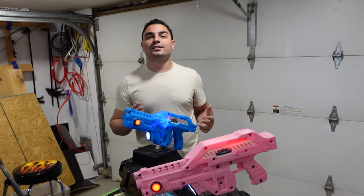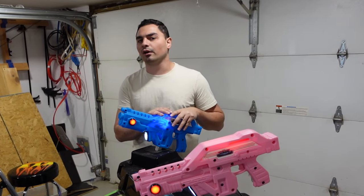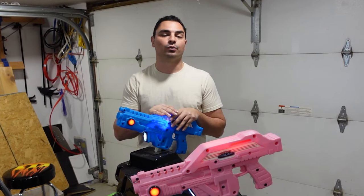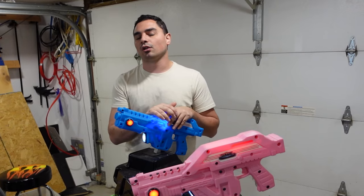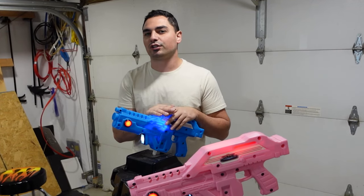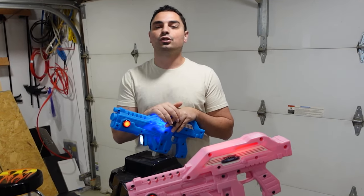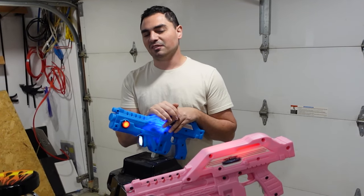The biggest fix that was needed was this right here, player two. The 24 volt solenoid totally burnt to a crisp because of an IO board issue. The IO board gave constant 24 volts to this solenoid and basically fried it. That then resulted, as we did the testing, in you being able to smell electrical fire burn happening in the heat of the moment. With a new 24 volt solenoid now and a new IO board, this is done.